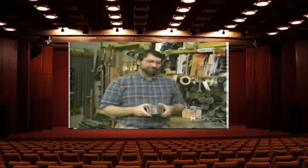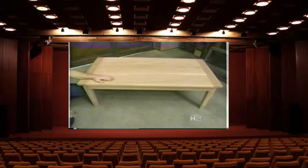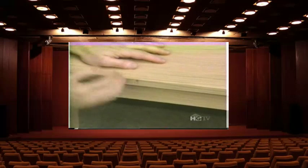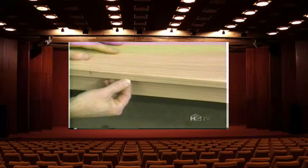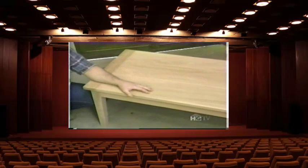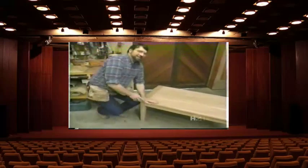Before leaving Graham Price Antiques, I managed to get one of his precious cans of wax polish. For the table itself, I liked the antique so much that I really didn't change any of the dimensions. The material appeared to be white oak, so I picked up some from my hardwood outlet. I've kept the tapered leg with the oak rail set flush. The antique had a nice thick one-inch top, which is important to the look of the table. This top is made from three-quarter-inch boards with a quarter-inch lamination underneath for that look of thickness. I put a little V-groove down to make it look like a planked tabletop. If you'd like to build one, we'll have a measured drawing and a materials list available.